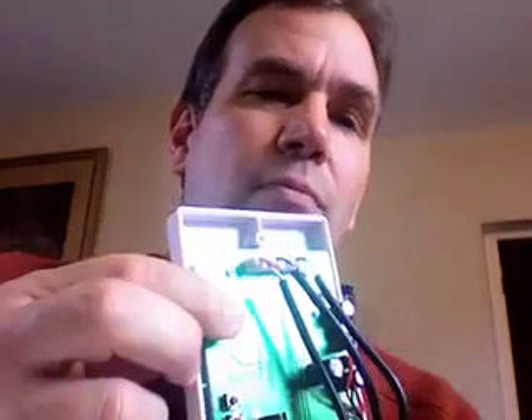You have set up your zero carbon controller. Simply press the reset button to get back to one temperature. Leave your controller showing just one temperature, because for safety reasons it's important to be able to know what temperature the top of the cylinder is and not to have any risk of confusion between panel, top of cylinder, and bottom.